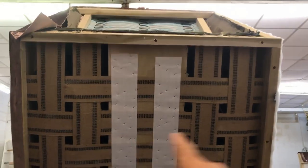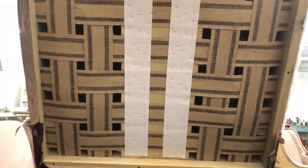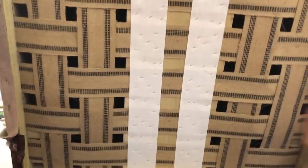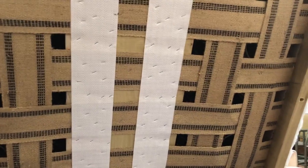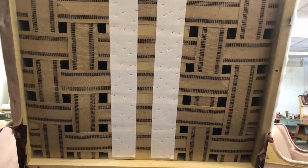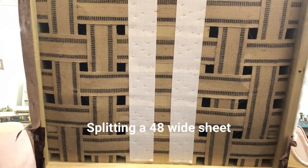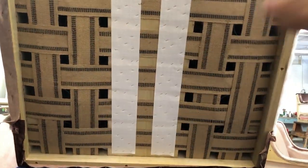If you'll notice, you've got a width here and a depth there. The way I determine the size of the round is I usually want to take the smallest number and give it two inches inside any wood that might be there on each side. I've come up with the number of 24 on this, but because my plywood is 24 exact, I'm going to cheat it by a quarter inch and make it 23 and three-quarters in diameter.